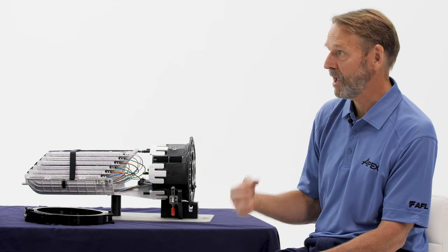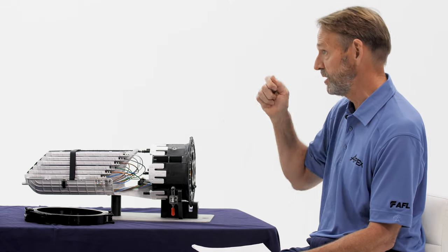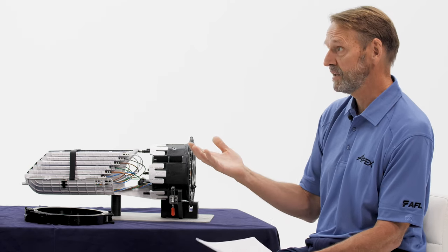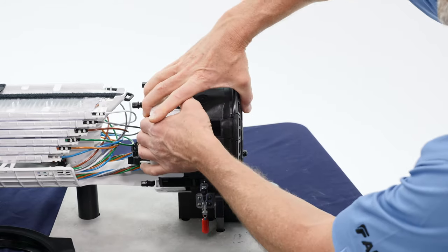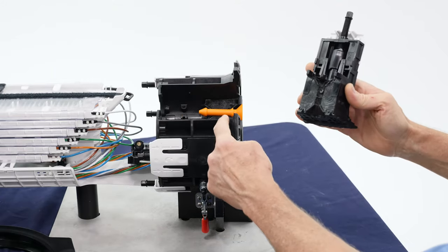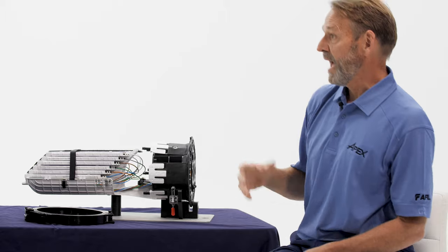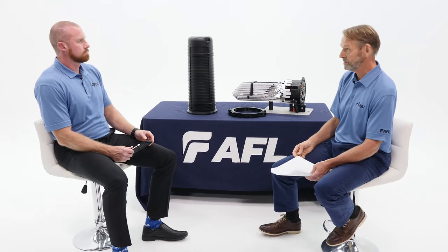Definitely the sealing system. As we created the requirements, we wanted to make sure that you could lay cables into the closure rather than having to feed them through individual ports. And because of that, we basically wanted to develop a new material. With a wrap-around cable like this, you end up with a triple point location — a seal between the wedge and the actual base itself. And that triple point is a very hard thing to solve.